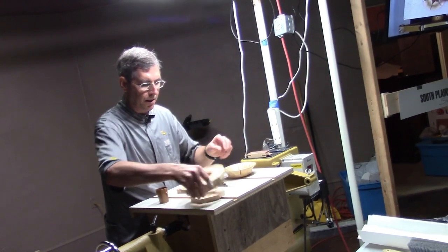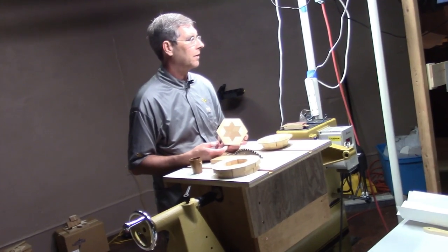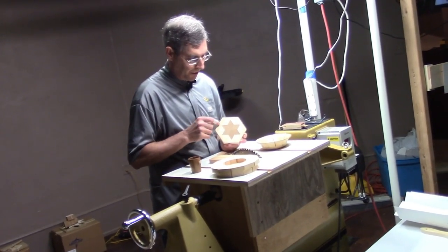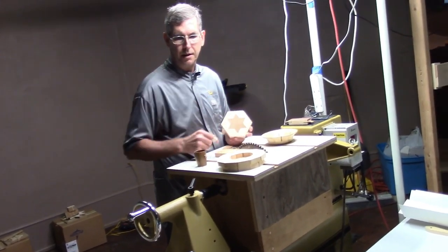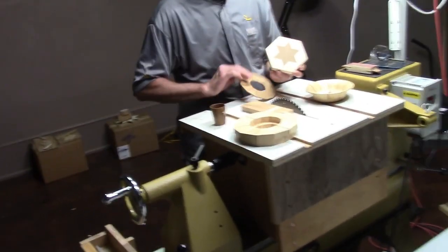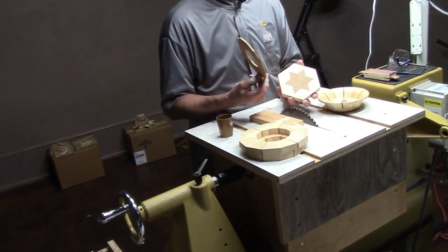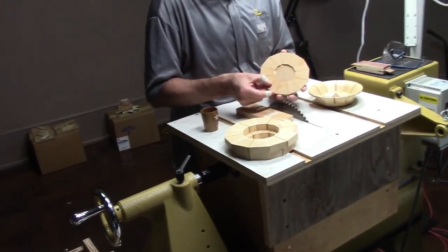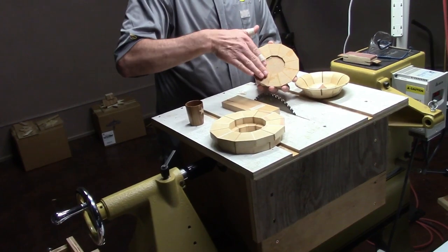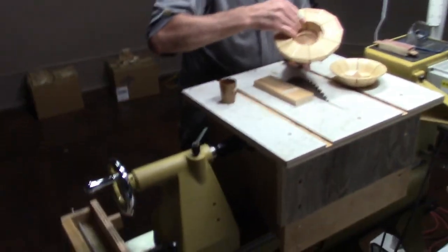So here's the idea. I need to build this 6-point star. And as a wood turner, I need to build a border out here so I have room to turn. So this would be the first thing I have to build. If I wanted to put a circle around that star, it's a cedar star, so I'd take a cedar border, put it down, and then as I turn through this, I form a circle. And it looks like that circle is part of this, but it's really not. Then I add two rings.